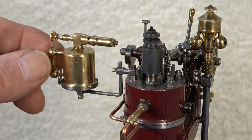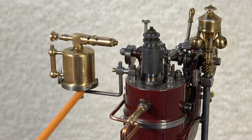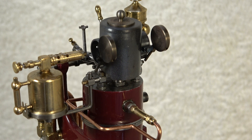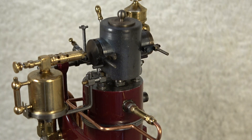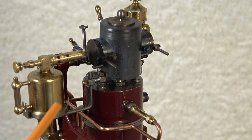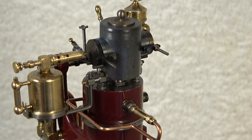Then I had to make a blow lamp and a bracket for this blow lamp. Then I made a hot bulb cover. This one is meant to prevent the heat from the hot bulb from escaping. The hot bulb cover has two hinge doors and a cap, and they are meant to be closed after preheating the hot bulb with the blow lamp. These doors and the cap also prevent the heat from the hot bulb from escaping.